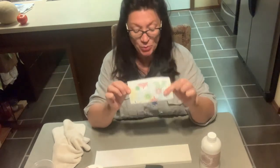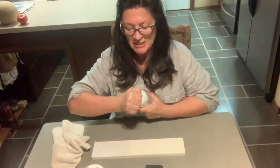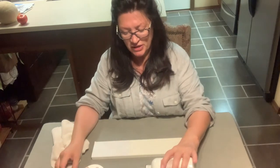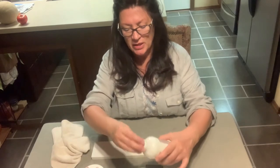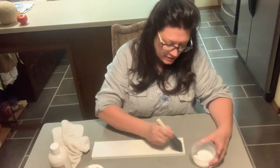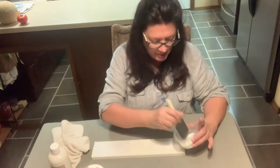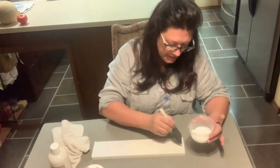I've got the image I'm going to transfer and I want to put it on my wood. What I'll do is add some Copycat to the jar — about how much I think I'm going to use. I'll eyeball it and may have to add more. What's important to note is that when this dries, it will dry a little bit shiny with a slight sheen, so you want to make sure that's okay for the piece you're creating. If it's not okay, you'll need to come back in with a wax or a sealer that's more of a matte finish. In this case, I'm going to seal it with a cerusing wax, so I don't mind if the shine gets a little bit on the outside of my transfer image.